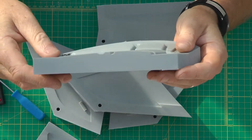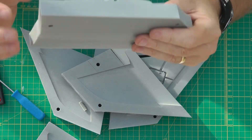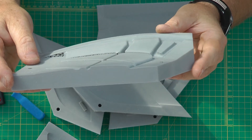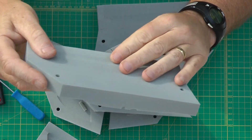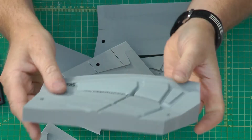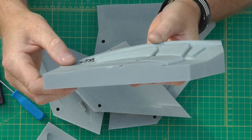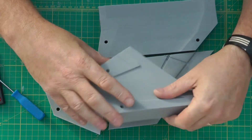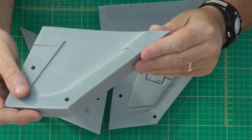It's one of those things where I'd ideally like to add perhaps another two shells — there are four shells currently — being as these are moulds. But printing at 0.1mm layer height makes the print time horrendously long. You've got to weigh up the odds — a little bit of repair, maybe half an hour here, versus about four hours of printing. As I get more experience, I'll be able to sort most of these problems out right at the source.